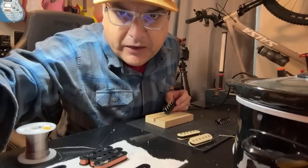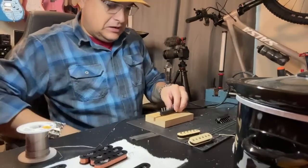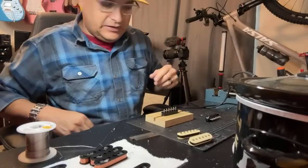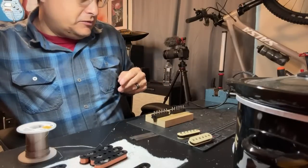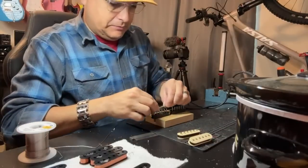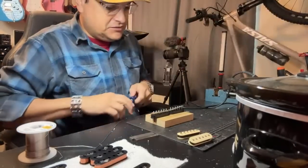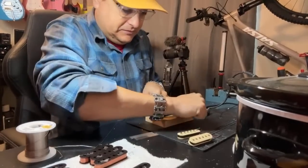The crock pot is for wax potting — it's actually heating up. We have some Tele 90 pickups here that need to be wax potted, so if the wax gets hot in time I'll show that, but I don't think it will during this live stream. Now that we've got the screw sides done, we come over to the parts bin and grab two 50-millimeter keeper bars because these are 50-mil pickups. This is exactly what you'd be learning if you came to one of our live classes.